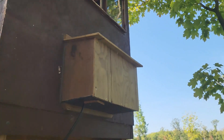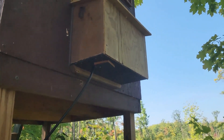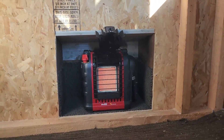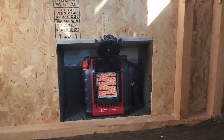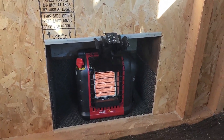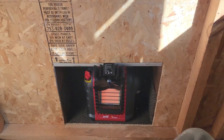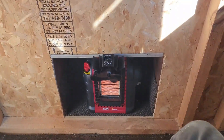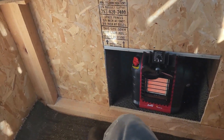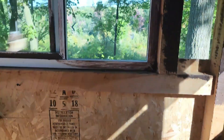And there it is — the finished install. I got the caulking down all the way around, ran the correct hose for the Buddy Heater up through the base and down to the tank on the ground, and turned it on to test it inside the blind. I also pulled it out just enough to mount the little stove fan on there — I'll put a link to that video in the description. Now when I'm sitting on my swivel chair I can spin around without hitting the heater, the heat's coming straight out at me, and the fan is moving the air. It's ready for hunting.